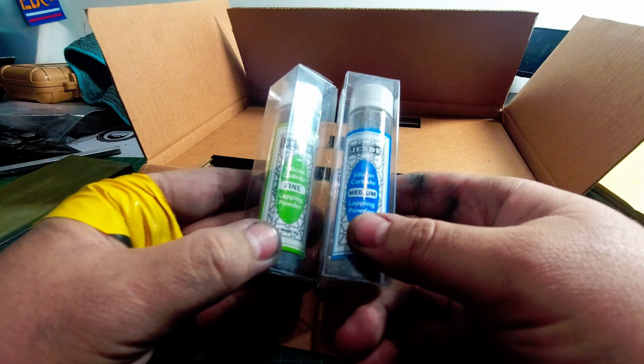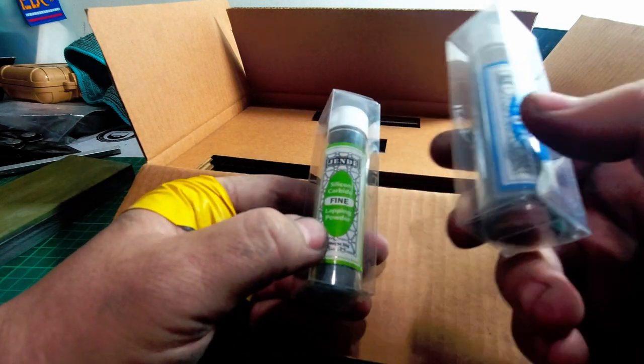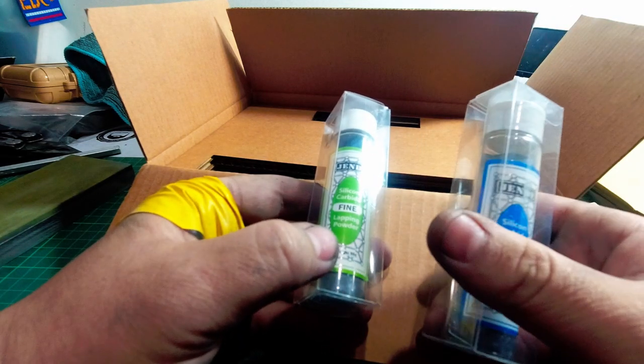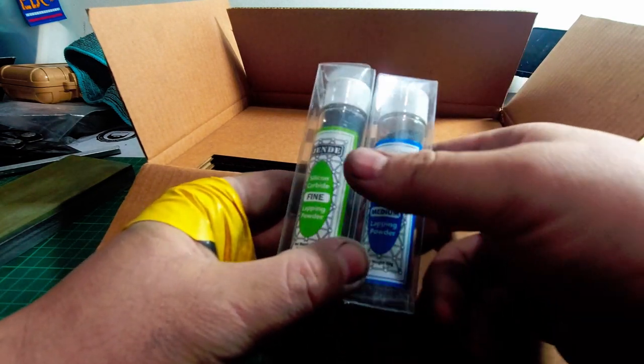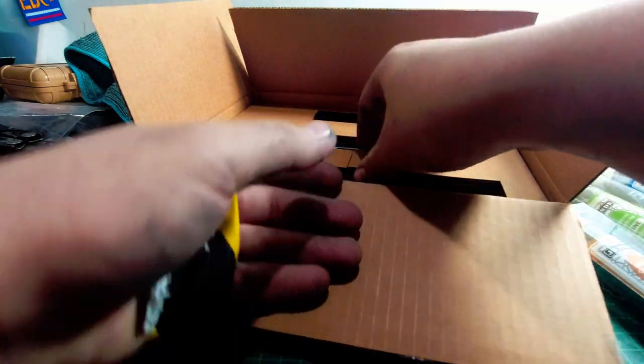You're going to want to use medium and follow up with fine. I suppose if you're doing in-between sharpens and you do lap, just using the fine should probably be fine. It's a lot of fines. But after the medium, you do want to go to the fine just to dress the stone, so it's not too coarse, it's not artificially coarse.